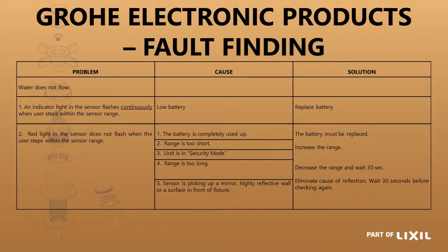As said, it could be that the battery is low. Check the red light in the sensor — if it does not flash, there is no battery at all, or the range has been set so short that it does not see you and you are still too far away. If something is in front of the mixer for 90 seconds with no change, it goes into a security or shutdown mode and will switch off into a lockout mode. You would have to take the battery off, drain the power, put it back on, and then it will reset itself. It could also be that the range is set too long, causing it to see things the whole time.